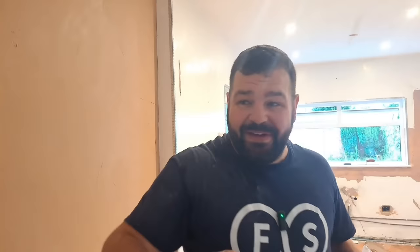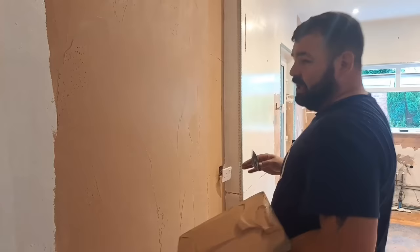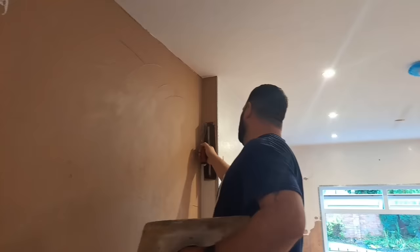If it slides when you're second coating, just leave the stuff. If it's sliding around when you're second coating, leave it. Brush it with a wet brush and don't touch it. Give it about half an hour, brush it again and then try to trowel it - it should stay still. But if it moves, just repeat that process: brush it, plenty of water, leave it.